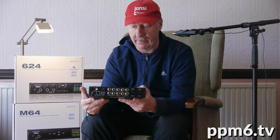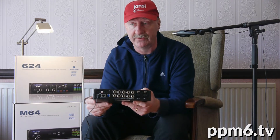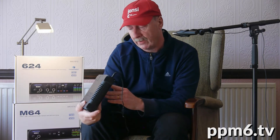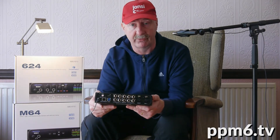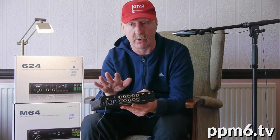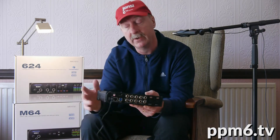There are really powerful options here. Because it's a network, if I add a switch I can plug in multiple AVB devices. MOTU tell me they've had a network carrying 512 channels of audio — I'll take their word for it, with a slight pinch of salt. Worth noting: AVB, unlike Dante, is not bog-standard Ethernet. In a Dante network you can use standard switches, but AVB requires different hardware protocol in the switch to guarantee latency and synchronization. The switch is a special AVB one — MOTU's is probably the one you'd buy, at £400 in the UK, which is a bit steep for a five-port switch.